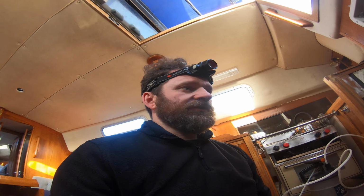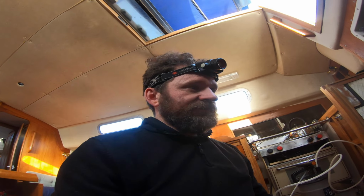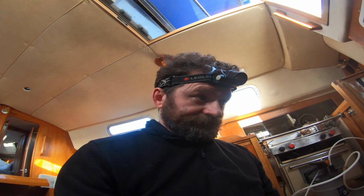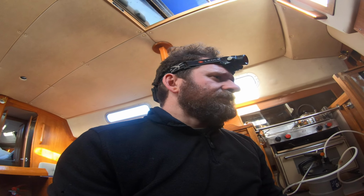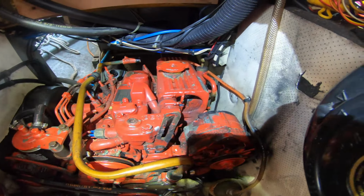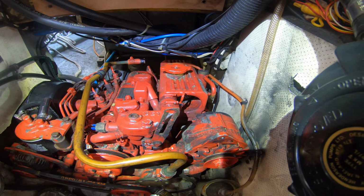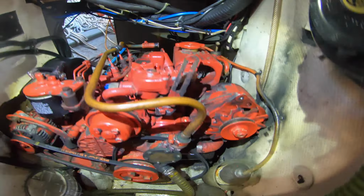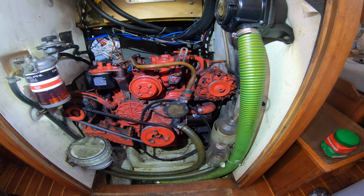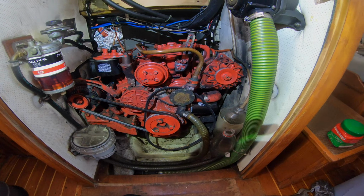But yeah, I'm going to do my best to get the tube stack out. I don't really want to go at it. It'll either come or it won't, and if it starts to give, then I will work it and get it out. But I think it needs to come out. I've now got plenty of room to do this in situ, which is great. As I say, removing this whole manifold was probably what I was expecting to do. Truth be told, I was expecting a head gasket failure, but as far as I'm concerned, I don't think that's happening, which is great. So basically, I can service these parts and put in fresh antifreeze and water to make the coolant mix up for the closed side. That's what I've been asked to do, and that's what I've achieved. So we're on the right path today. It might be a long day, but hopefully we'll get it done.